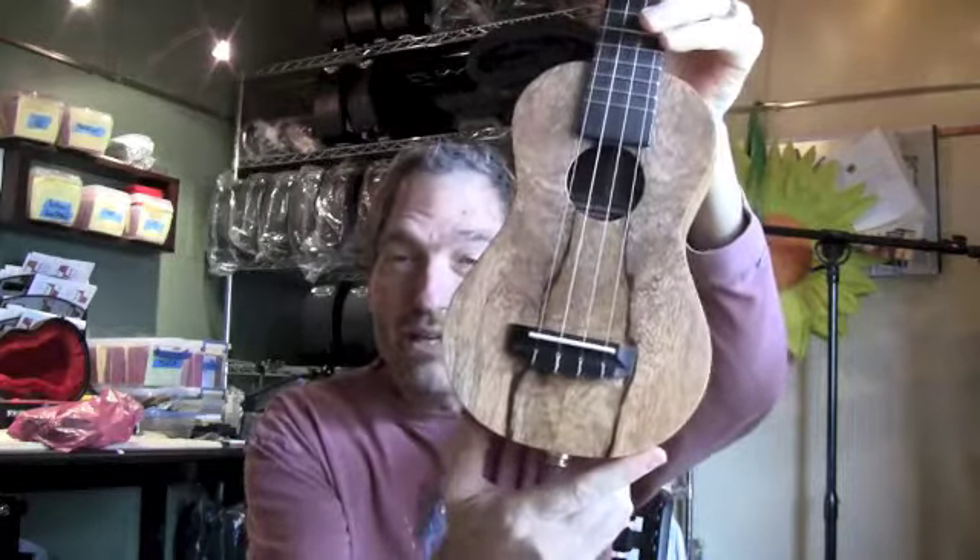As you can see, the front and the back are both from the same slices of wood — they're consecutive slices — but the figuring is quite different. We said yes, it's the same set of wood he picked out, but what has happened is that as we sand the wood the figuring moves. We really try to have that happen as little as possible. When you pick out your wood and you see the figure that you want, it is what you want, and yet if you think of that board with each slice this way, generally the lines that make up the figure will move.